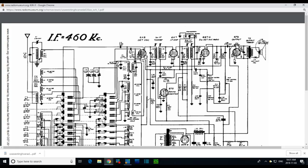I can take the temperature of the tube itself. That's tricky to do. I have an infrared meter here, but you're shooting at glass, which is hard first of all, and then hard to read a temperature on, and all this stuff inside here is glowing away, and I'm sure it's emitting thermal radiation that my instrument would pick up, so it's pretty tricky to get.